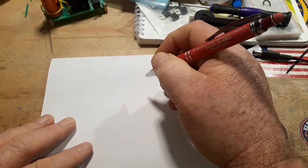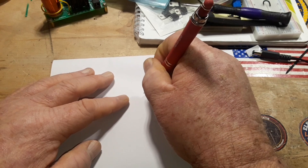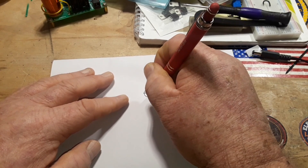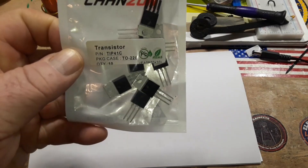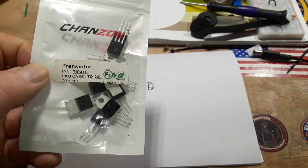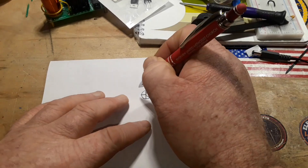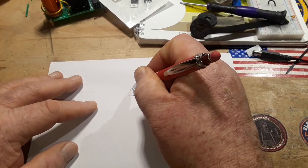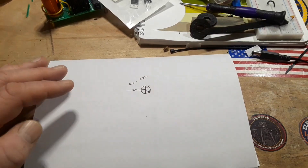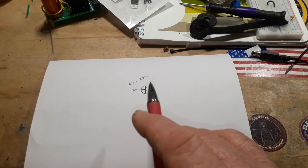Let me show you the circuit diagram — it's pretty simple. Everything is based off a single transistor. The ones you'll find online generally use a 2N2222, which is a great NPN transistor. But you might want something meatier — something like a power transistor. These are TIP41Cs, which are a lot more resilient. The first thing we're going to do is bias the base of our transistor with a resistor anywhere from 10k to 22k — that range is fine. We're just keeping the voltage down on that gate.